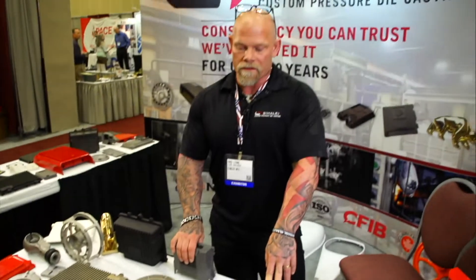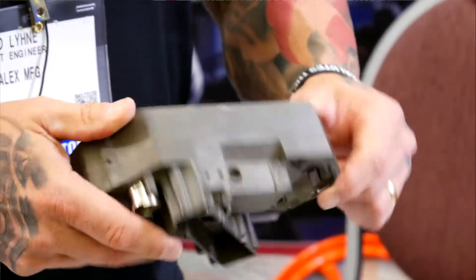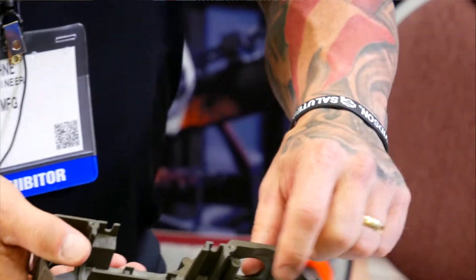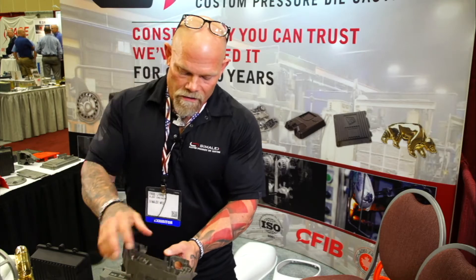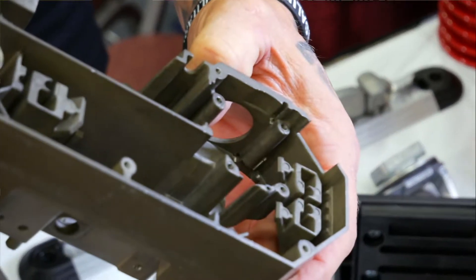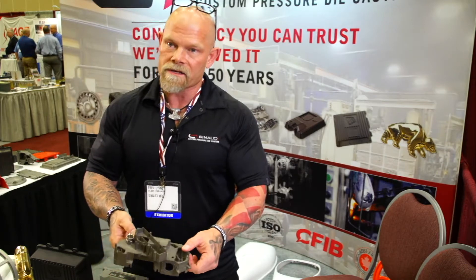Specifically, we make engine components for the engine that goes in that particular truck. Here is a perfect example of a die casting that, by conventional means, should not be able to be cast. Thin walls and these little features on the inside — all these empty areas where you see light coming through require a shutoff point in the tool. In other words, we have to seal the tool from one side to the other, as well as we have side action where all of these holes are cast in place.